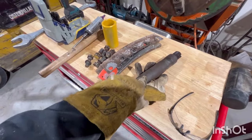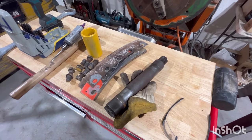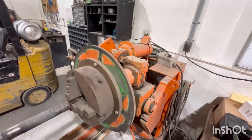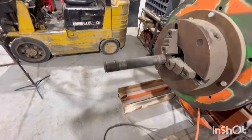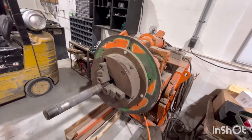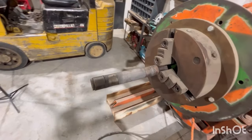I'm going to get the shaft set up in this manipulator and make some passes around this guy. We'll try to get that done tonight and then maybe machine it tomorrow night, let it cool down in between. This is strictly made just for welding off of - it's way overkill for what I need, but I do build some engines off of this so it doubles as an engine stand. It's got a foot pedal, you can make it spin either direction, or you can stand things straight up and spin them that way. You hook your ground up on the back side on a pivot so it keeps your piece grounded. I went ahead and preheated this shaft.